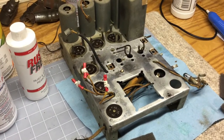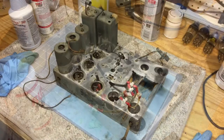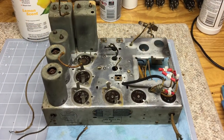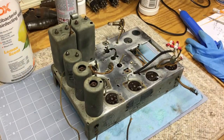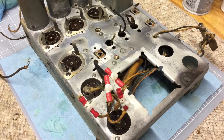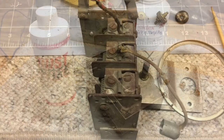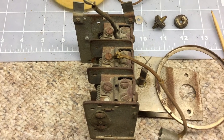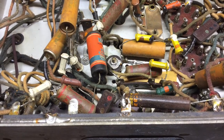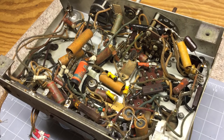After the process, you can see I've got about 90% of the chassis de-rusted and cleaned up — looks a heck of a lot better. I'm not going to paint the chassis; I'll just leave the rust inhibitor on it, and like I stated in the other video, if I'm still doing videos in a couple of years, I'll produce another video and we'll see how well it holds up. So I'll continue the rest of the rust removal, get the grime and dirt off the chassis, get that power transformer remounted after it sets up and dries, get the tuning condenser remounted with the new grommets, and then start right on the electrolytic capacitors — get those re-stuffed — and then start the remaining electrical restoration. Stay tuned. Hope you enjoyed. Thanks to my new subscribers out there.